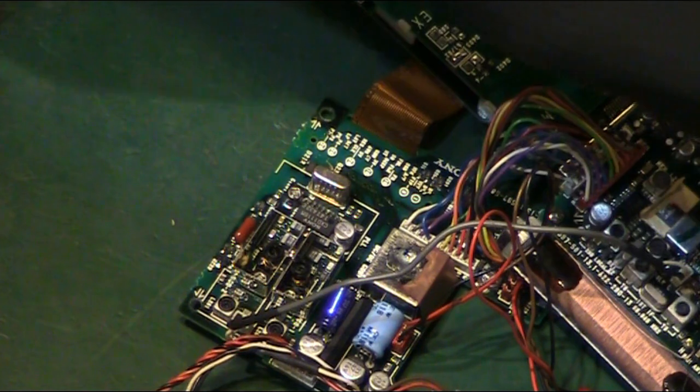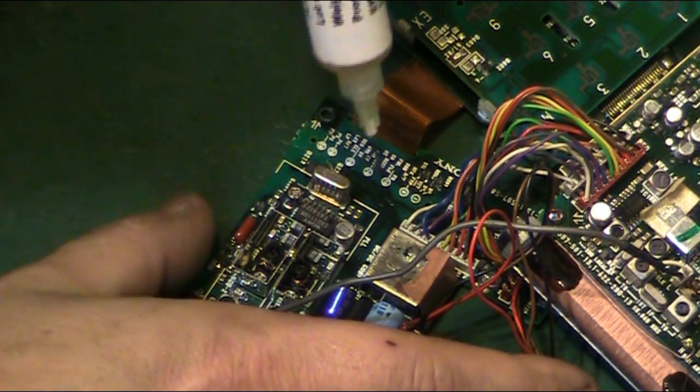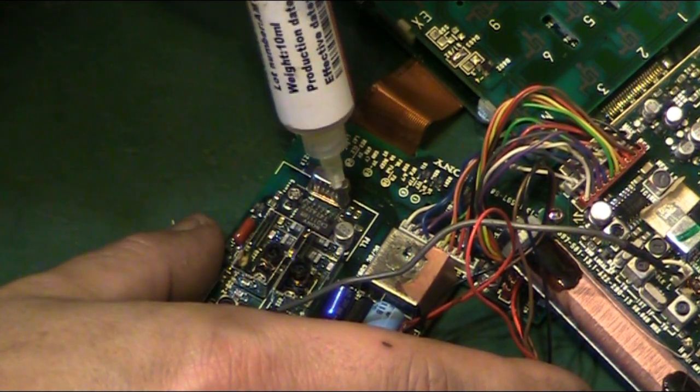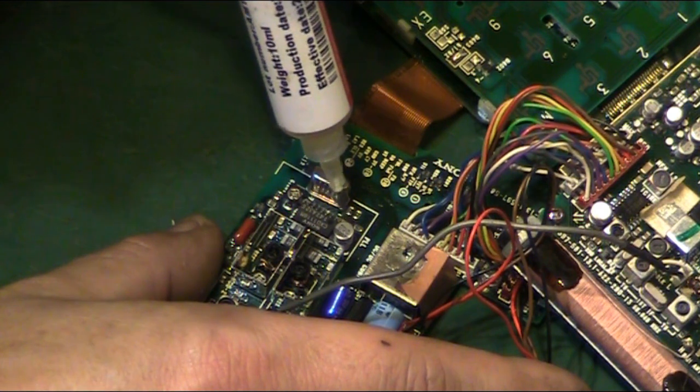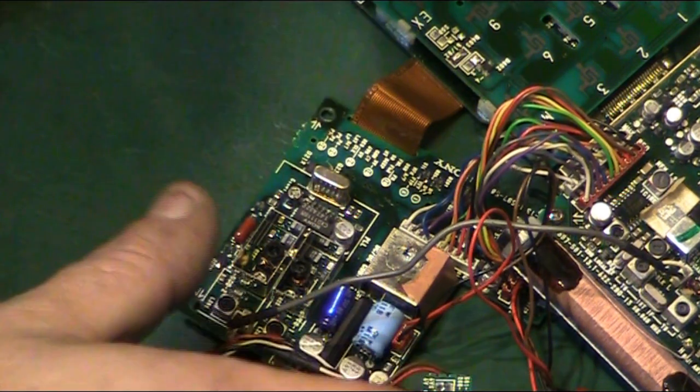I'll grab my cleaner there, and I realise that I've actually left my flux in my soldering drawer. But it shows me I'm getting prepared for doing videos, doesn't it? Right, there's my flux. And I've already got my Q-tips and other bits just off shot at the side of me here. So first things first, we'll add a touch of fresh flux. This will just help the old solder flow a tiny little bit. Don't need very much, it's a tiny little bit.